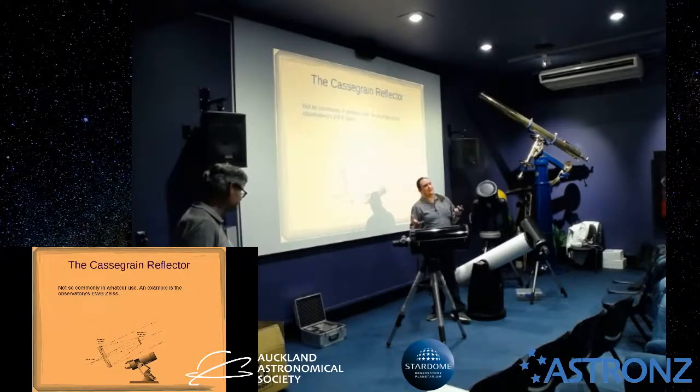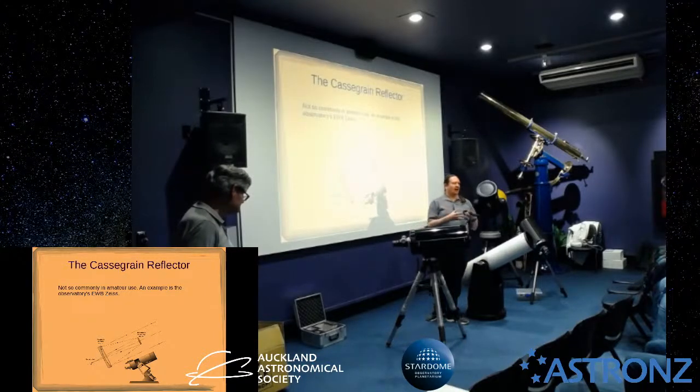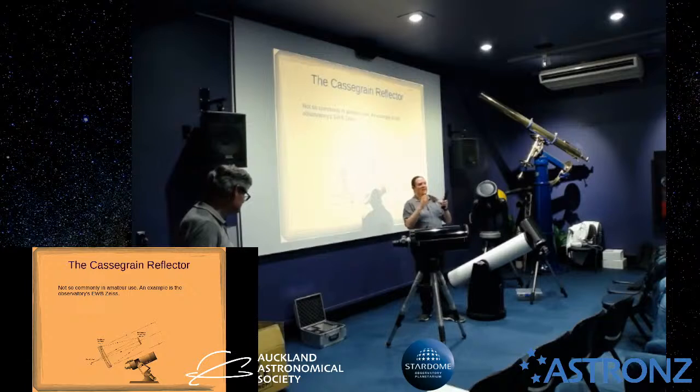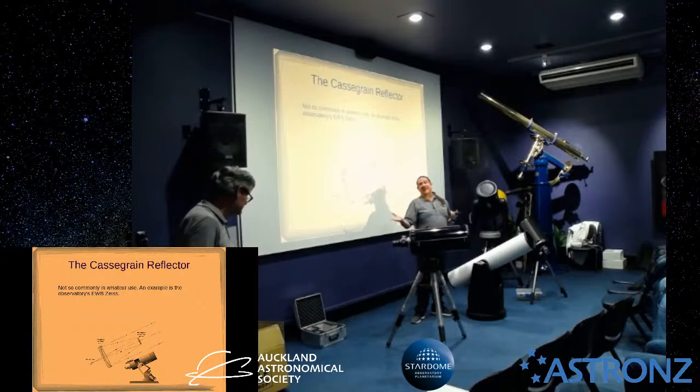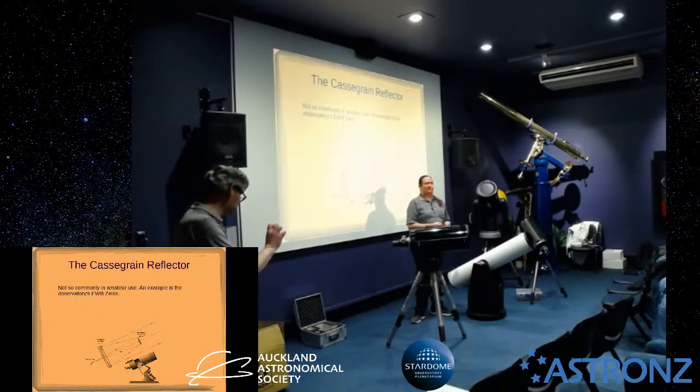Most guides will then say, look at an in-focus star and have a look at the Airy disk around the outside of it, the ring that you can see around a perfectly focused star. You just about never get the seeing good enough. This is actually where an artificial star can help. On a real star, have you ever actually managed to see the Airy disk around a real star? No, there's usually too much turbulence. You need a high magnification and there's usually too much turbulence.